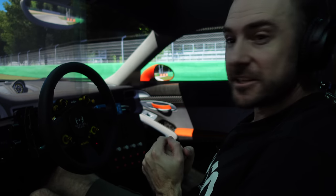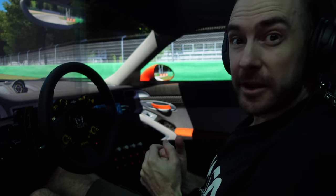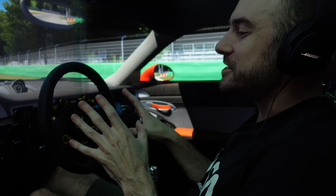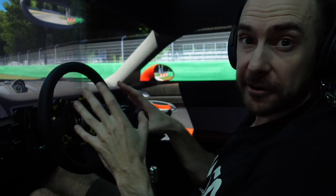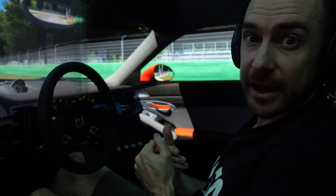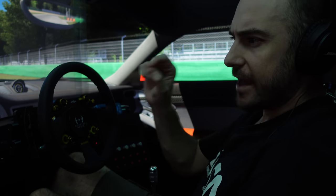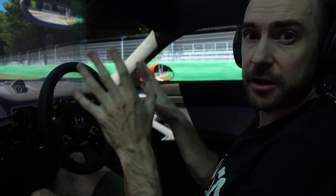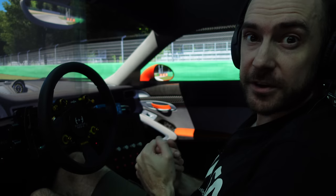Now, one of the things that I'm sure you've probably noticed by now, there's probably already a million comments from people that didn't watch the whole video before commenting. You might've noticed in the previous perspective that we did from this angle, there was quite a lot of flickering going on with the camera, and that's caused by the PWM or pulse width modulated LED strips that we're using here. They actually pulse the current on and off to create the dimming effects. So that can often cause a bit of a flicker. You don't see it with the naked eye, but it can be a bit of an issue when doing content creation.